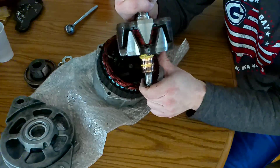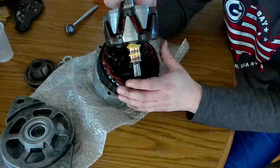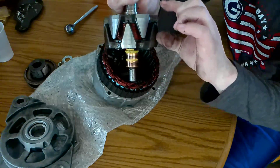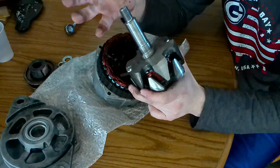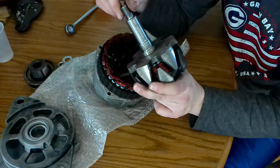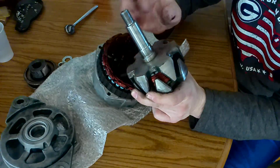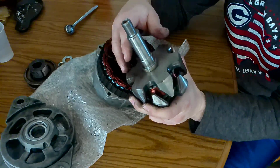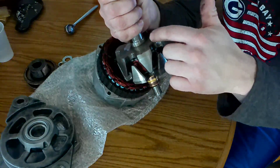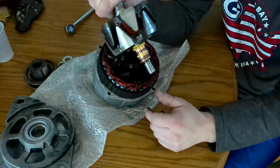In a previous video I showed having 115 to 120 volts out of a one-wire type alternator. What I did was take these two halves, separated them, took the claw off, removed all this copper winding, and replaced it with a large donut magnet that slipped into place roughly the size the windings were. That takes the polarity north and south and creates your alternating current.